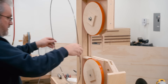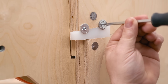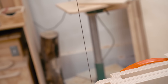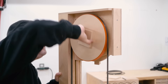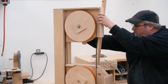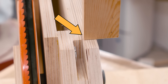With that much done, I can get a quarter inch blade on and see how it works. To increase the tension, you loosen the screws, slide the wedge over, and then tighten up the screws again. It looks good with a quarter inch blade, and now I've got a half inch blade I'm going to put on and try that as well. What I'm doing here is checking how much the frame twists when you tension the blade — I've got a stick that extends down to where the table will be, and when I tension the blade you can see it moves a very small amount.